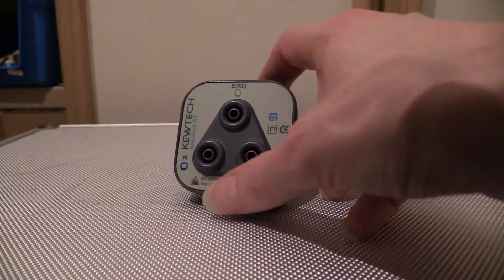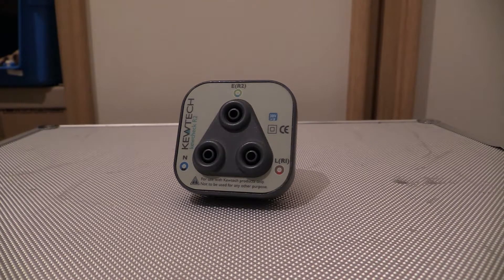You put it in the wall socket, then on the front you put your test probes in and carry out the relevant test. It can be to see whether the socket is live or dead, check the voltage, earth continuity of bonds, insulation resistance test — all of that. And it doesn't have to go into a wall socket on a wall; it could be a socket on an extension lead. When doing continuity on a conductor on an extension lead, you use one of these to get a good connection on the socket end, put the relevant test probe in the relevant hole, and carry out the tests.